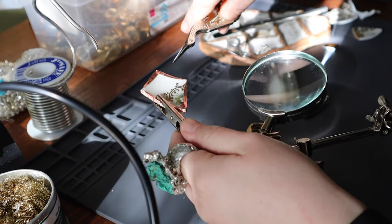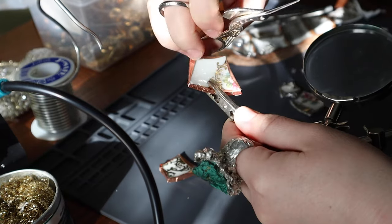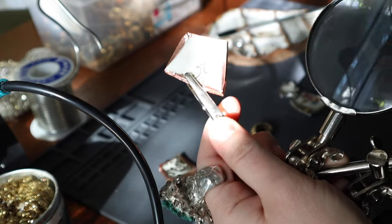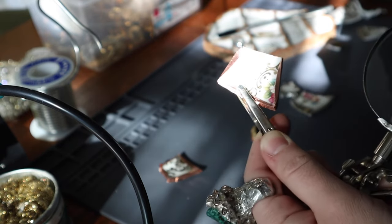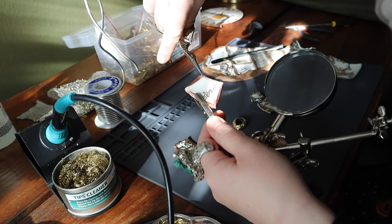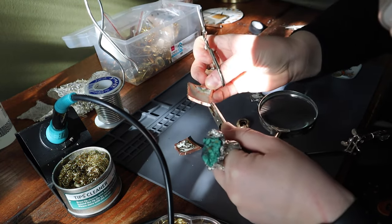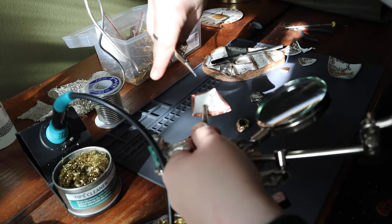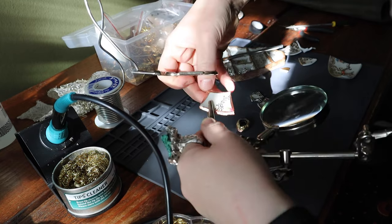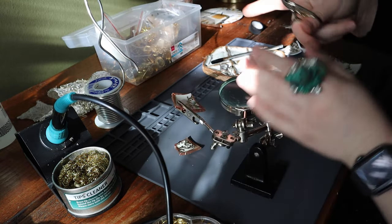I just want to talk to you about these pieces. Sometimes you can see that there is a fold right here. I don't know if you can see the fold, but there is a fold right here. Snip it off. Don't leave it, because it will not behave well whenever you are soldering. So try to make it as flat as possible. So just cut it. You have this opportunity now.